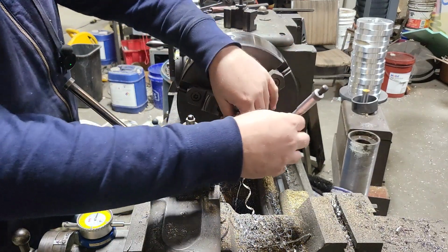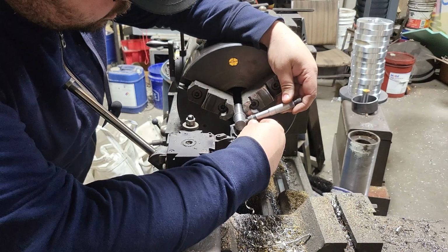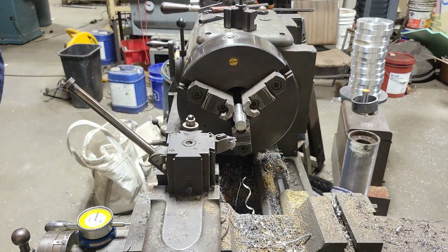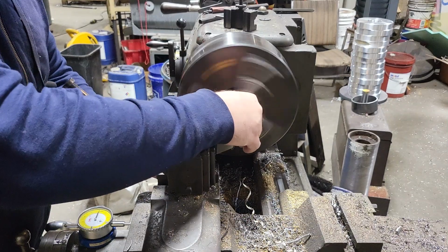All right, let's see where we've ended up at. So, actually we are just over, about a 1/2,000th over, so that worked out great. And I'm going to take some 120, and I'm just going to polish this up and get that 1/2,000th back off.